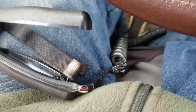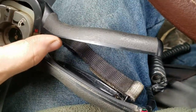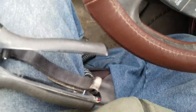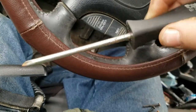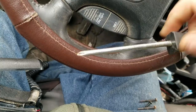I was able to gently pry it apart. It seems most of it stays on the left side of the controller, so you want to try and peel away the right side. On the screws, mine were a little tough especially the top ones — I didn't just zip them right out. I would loosen them and then tighten them, loosen them a little more and tighten them back up, just work it back and forth all the way out. That seems to be the new norm for stuff that's really stuck.